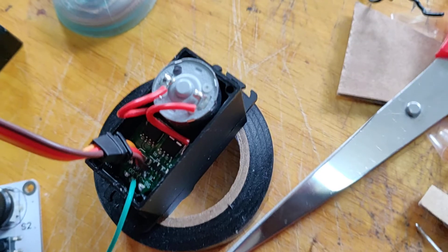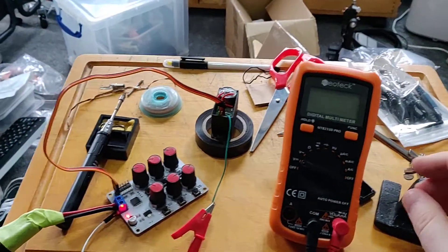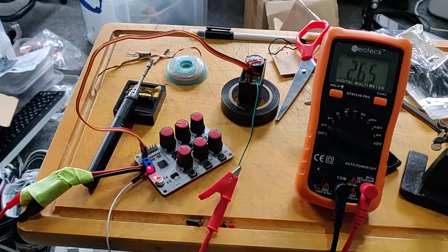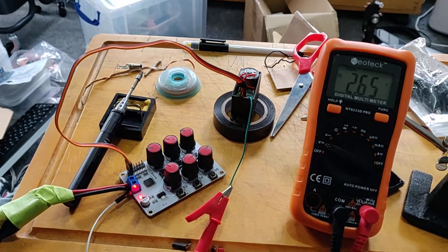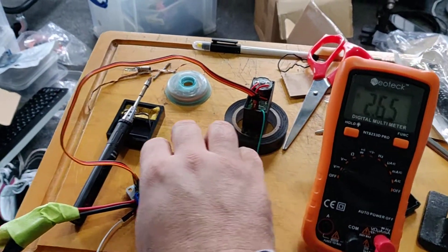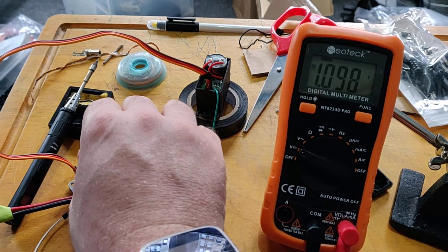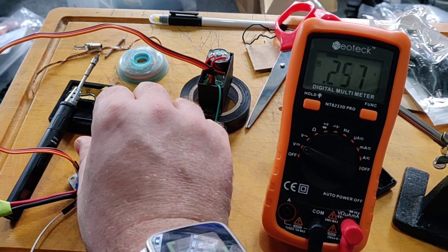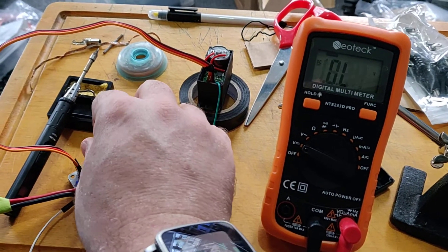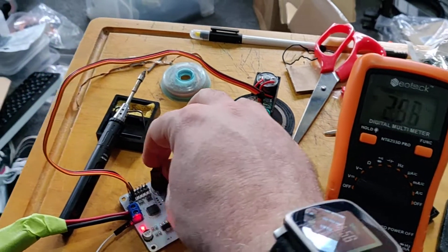At the minute you can see I've soldered a green wire to the middle pad. The batteries are almost dead on this now. Basically what that means is that the potentiometer used by the servo itself to find out where its current position is — you can tap into it and get an analog voltage reading back. You get 0.25V at one extreme and 3.6V at the other.